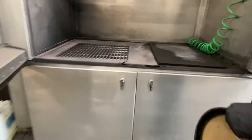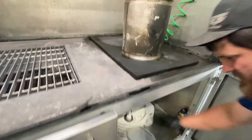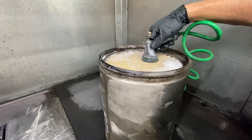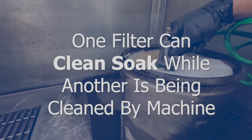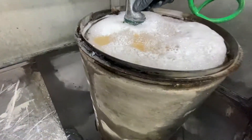This method has proven to be a more effective option than air. Now it's time to place the filter inside the wash cabinet to perform a clean soak. Notice that the filter is resting on a rubber mat that creates a seal with the filter flange. We then add fresh surfactant to the face of the filter and use the flush gun to fill the substrate with clean, treated water. This process can be done while another filter is going through the computer-guided cleaning process inside the cabinet.